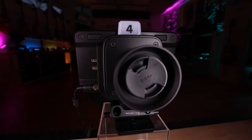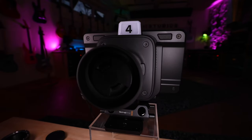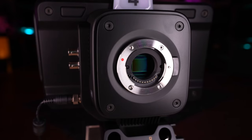I never knew. Now, if you ask me, if you're not going outside with these things and you intend to have them fixed in a studio setup, a combination of the Plus or Pro, depending on what you want, and the Micros is what I use, and it is amazing. It is upgrade proof because they can work in 4K through HDMI. It's not like the Pockets. HDMI is full 4K and SDI. You can record on the cameras in Blackmagic RAW with USB-C.